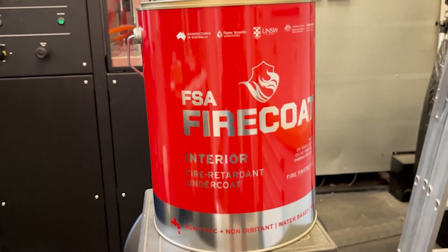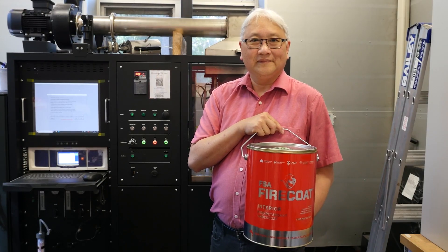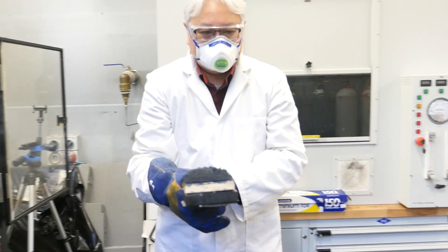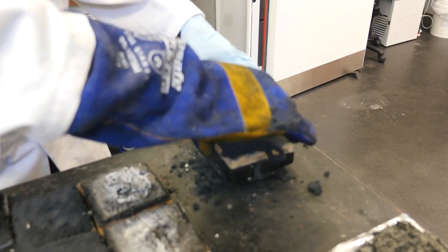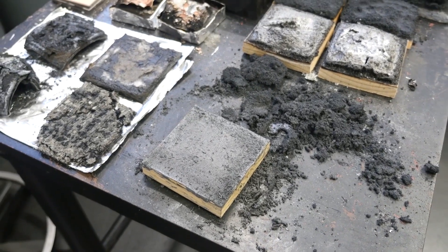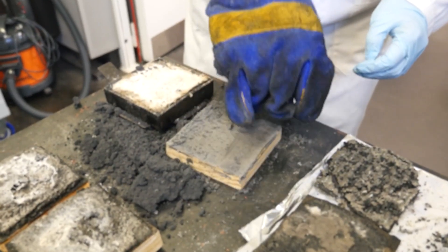FSA Fire Club is a paint — more technically called an intumescent paint for exterior and interior applications. What intumescent means is that the layer grows over time as it is subjected to high heat, and that layer acts as a barrier to fire or oncoming heat to the walls of houses. Because of that so-called intumescent or char layer, it holds itself even on a vertical orientation.